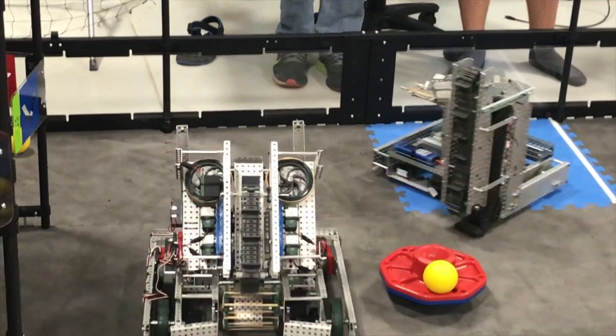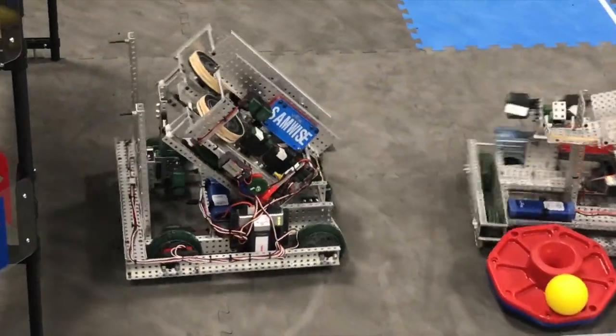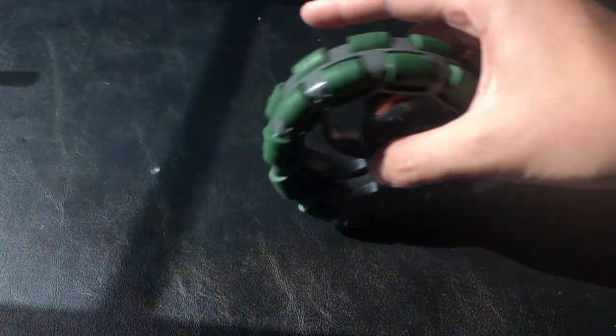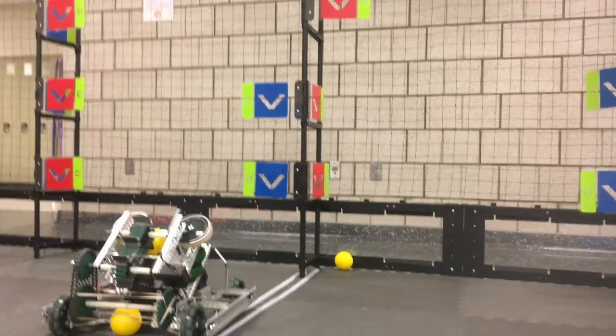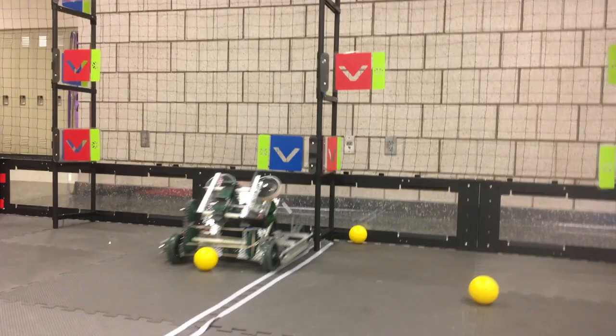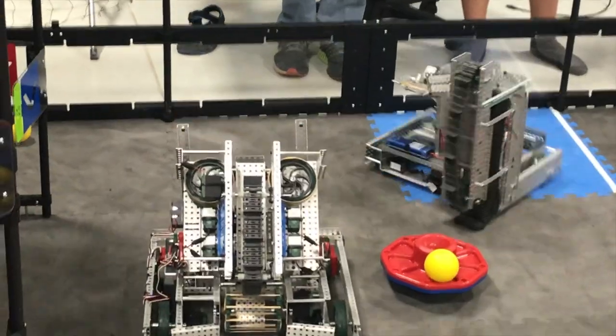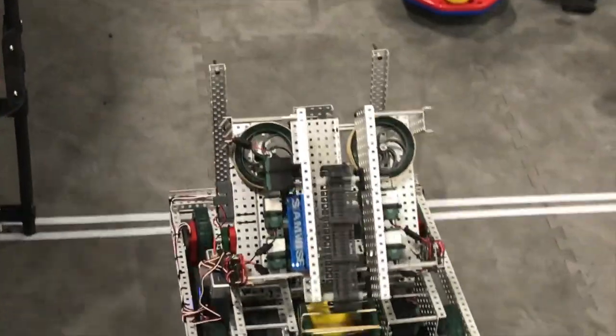Let's talk wheels. There are two main varieties of wheel: your more traditional traction wheels and the more exotic omni wheels. Omni wheels are very cool because they have these rollers on the edge of the wheel, which allow the wheel to roll parallel to its axis of rotation. In most circumstances the omni wheel wins. Because of its rollers, it results in less friction when turning, which helps the robot turn more quickly and helps prevent the motors from overheating. The downside is that you can be pushed from the side more easily. The traction wheels don't turn as easily, but they do prevent you from being pushed from the side.